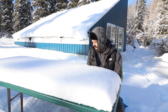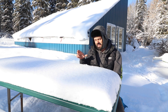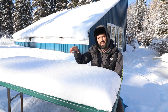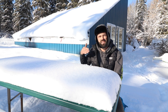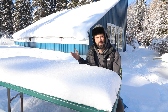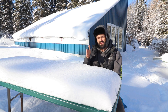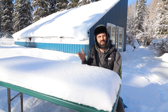I made a few mistakes on the polycarbonate. The sheet is 24 feet long, taking up six skid spaces in a truck, but because it's six feet wide it's actually a skid and a half — and nobody ships anything as a skid and a half. So I had to pay for 12 skid locations in a truck to ship it north, adding about $1,500 in shipping. The upside is that with a six-foot panel, my rafters are every three feet versus every two feet with a four-foot panel, so there's less shade on the ground, but I'm not sure that premium is worth it.